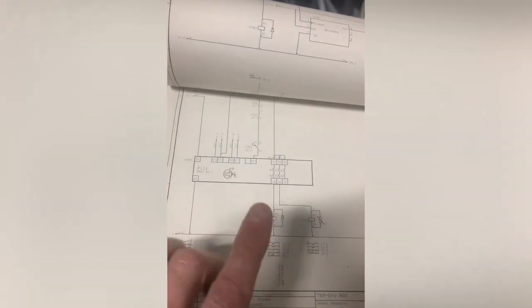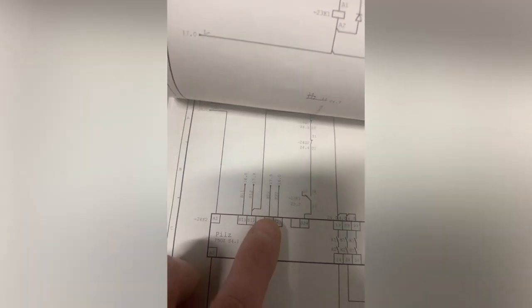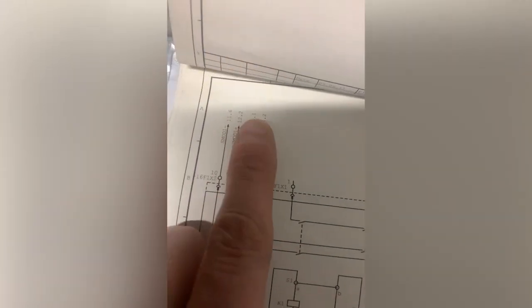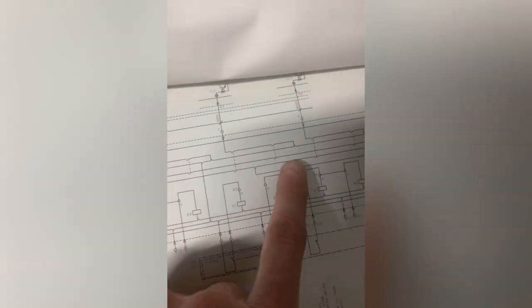This is just what you get when you've worked with drawings for a long time, and this is what you need to be able to do. So that little bit of information there, that they're mishmashed, tells me something. Look at that for a drawing. Welcome to the world of safety circuits. So it's not as old as it looks. Here, look, I can see my terminals. There's my S11 and S21 at one end. Go down here, down this chain. Next page.